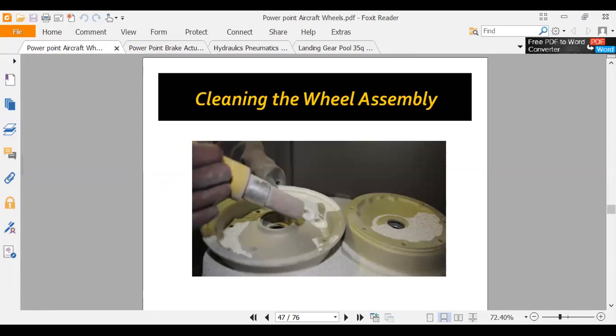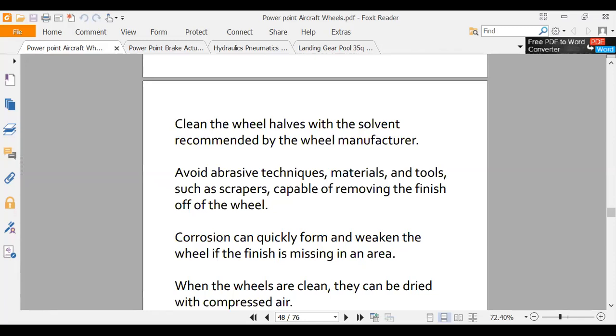They're bead blasting it. It's in a bead blast that's glass beads, kind of like sandblasting, but with beads. Sometimes with these airplane wheels, they'll use something like plastic beads, because remember, these are aluminum. They're aluminum and magnesium, so they're soft metals and they're damaged easily. Then we'll also use chemicals. We don't use things like a wire brush that will destroy the aluminum in these wheel halves. We look for corrosion. Corrosion's bad. Usually we have limits of how much corrosion we can have.